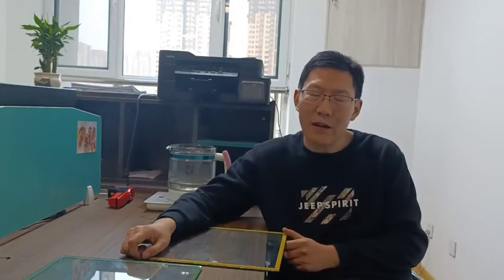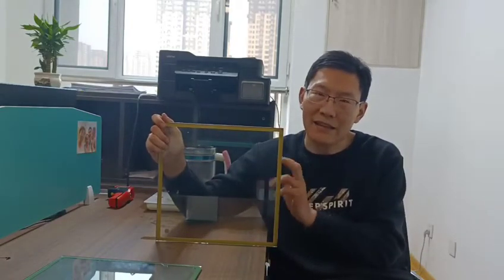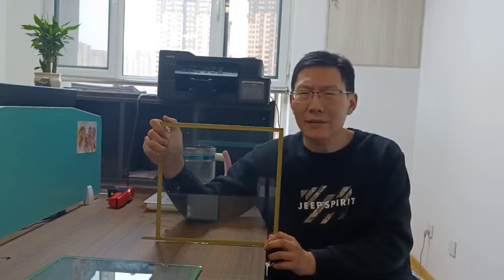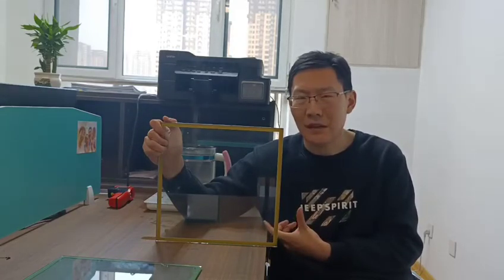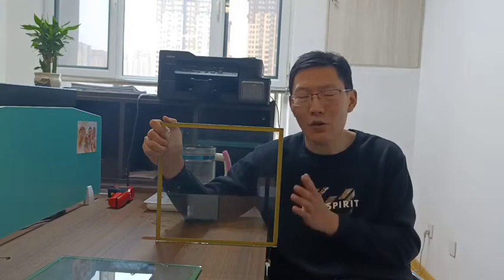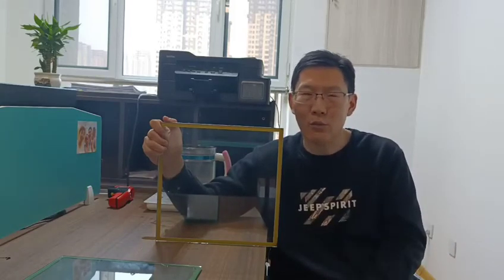Now the test has been finished. The vacuum glass used in the test has a lab-tested U-value of about 0.47 W/(m²·K). The insulated glass is 1.6. Based on our test, the front side and back side temperature difference for vacuum glass is about 60 degrees, while for insulated glass it is about 45 degrees. It means that vacuum glass can block more heat from entering our rooms, and also block heat transfer to the outside in winter, keeping our rooms warmer.